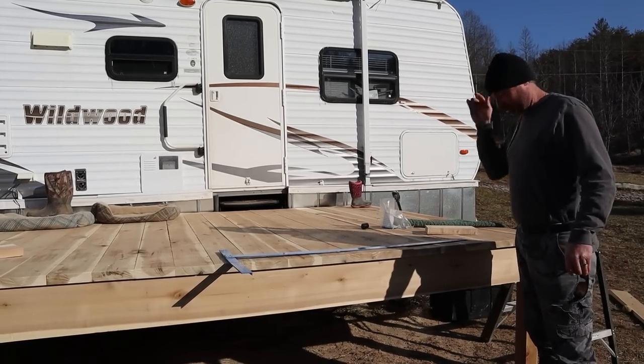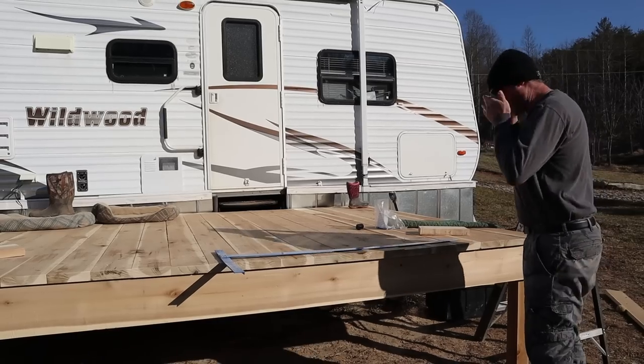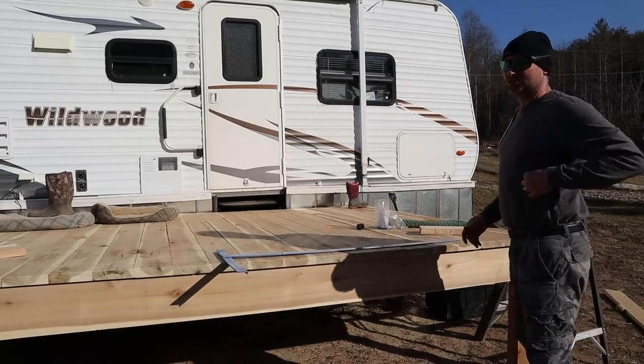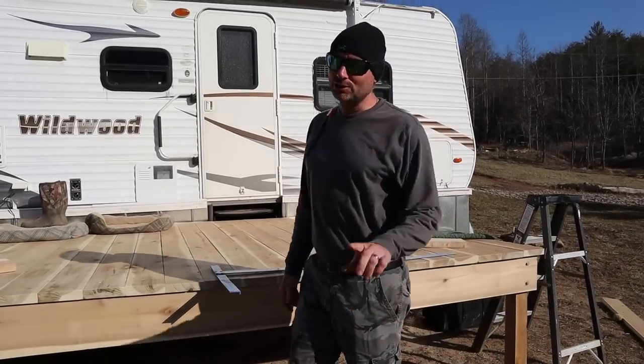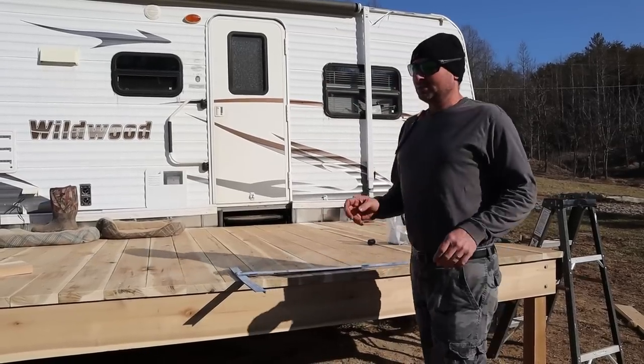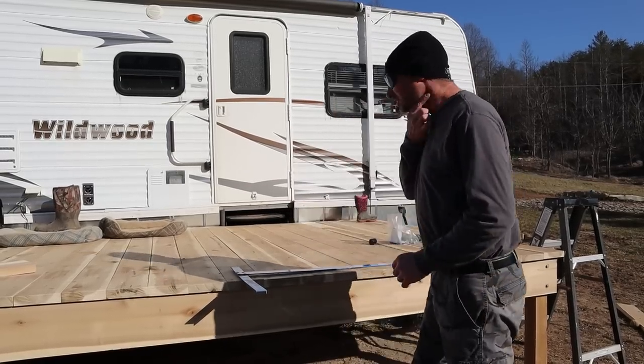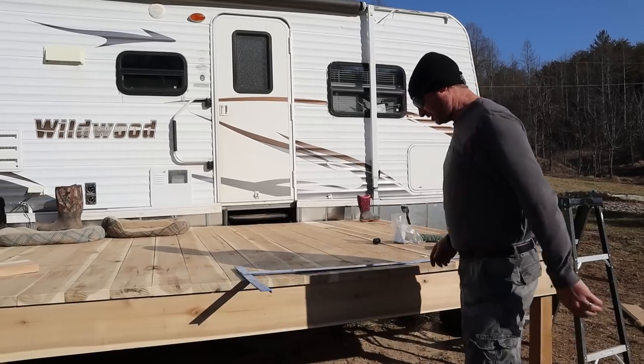Girders should not be... Girders, you know, the little zigzaggy things that you put stairs on? Aren't they stringers? Oh, sorry, yeah. Not girders. Okay? Stringers, it's not recommended to have more of a span than 18 inches. And if I do it at 4 feet...